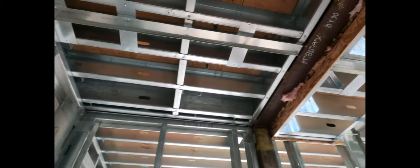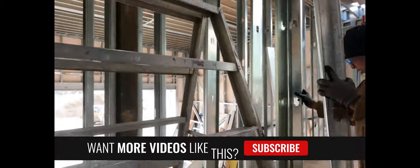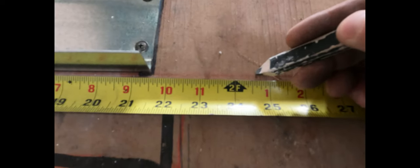You guys are responsible for your layout — it's super simple, just copy the drawings. If you need to learn more, leave me a comment and I'll link you a video. Because the ceiling elevation is at different heights there, I'm using two pin lasers to plumb up either side of the door. Normally I would just plumb up one side and use my tape measure to measure across.